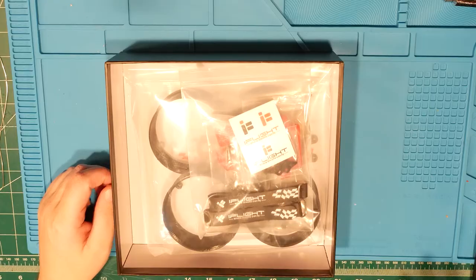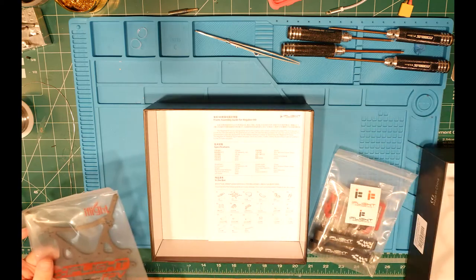If you want to scale down like a 4S to something that you can actually fly and give it heft and weight that makes it feel more like a heavier quad, then I definitely recommend the Johnny FPV 2.5 frame, because the combination of those motors, 2.5-inch props, you can run pretty much any prop you want on it, and an 850 battery on top, that's a heavy battery, the thing feels amazing. I mean, it feels like a 5-inch quad when you fly it. It's just kind of a fun sort of thing. But anyway, enough jibber-jabber.